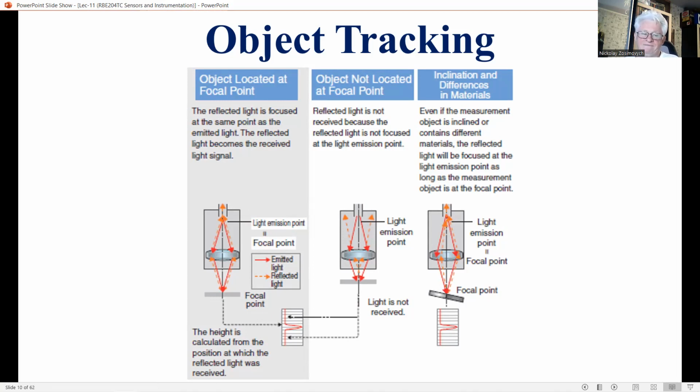It should be mentioned that active lighting systems may also comprise a camera, like line, matrix, and 2D PSD. However, the object that is looked for is illuminated by a known light source, such as a laser spot, or laser line, a pair of lines, or a 2D light pattern, also called structured light. The reconstruction process combines knowledge about that light source and the image of the reflected light.